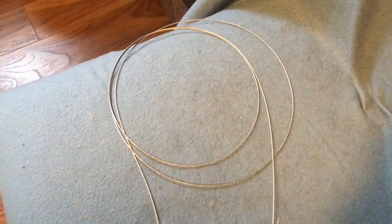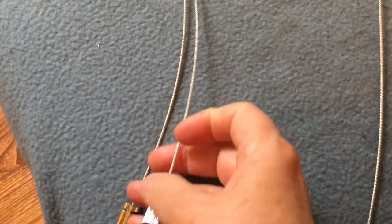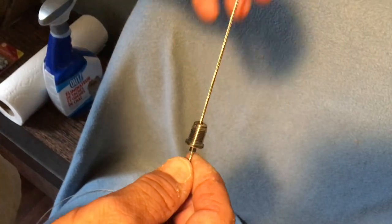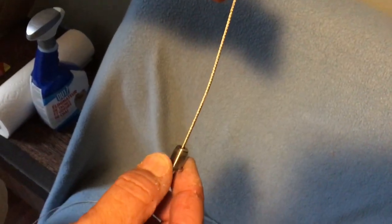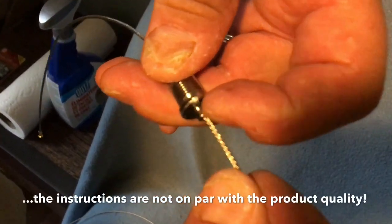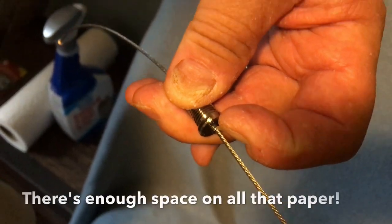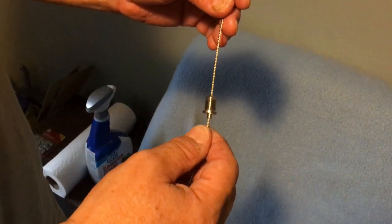Here's what the wire looks like when it comes right out of the package. This is one of the two pieces that's in there. The end on the left has two strands that are attached to the two corners of the light using those screw bolts. The other end is the part that goes up to the ceiling through this fitting. To adjust the length of the wire, you just grasp the fitting and pull on the excess wire to make the long section shorter — the part that goes to the light. But if you find that's too short and you want to make it longer again, you compress this tiny spool in the middle of the fitting and pull the wire back out and it slips very easily. This isn't anywhere in the instructions.